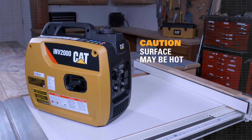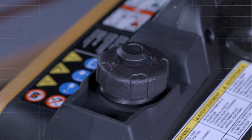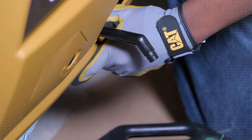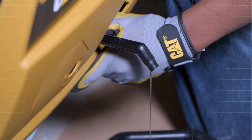Perform the oil change using the following procedure. Operate the engine until it reaches a normal operating temperature, then stop the engine. Close the vacuum relief valve on top of the fuel cap to the off O position. Open the right service door and remove the oil filler gauge. Attach the oil funnel and tilt the generator to drain the oil into a suitable container.